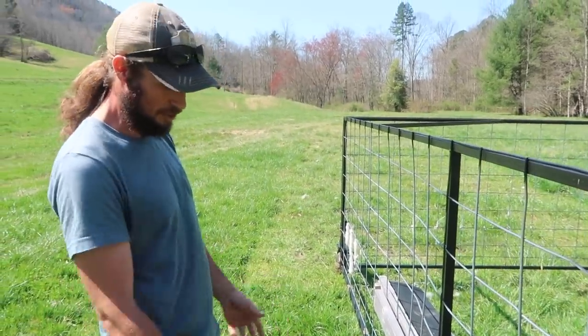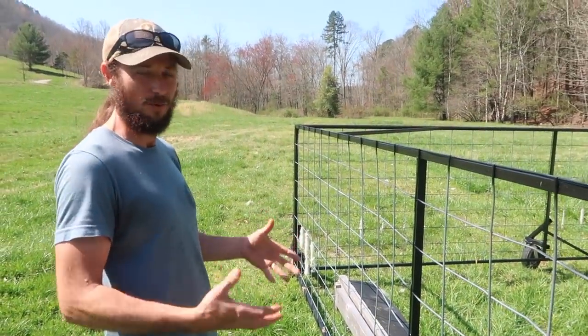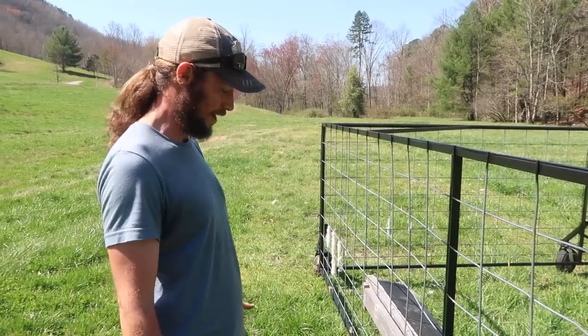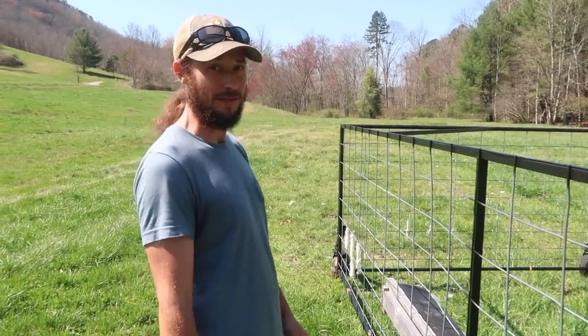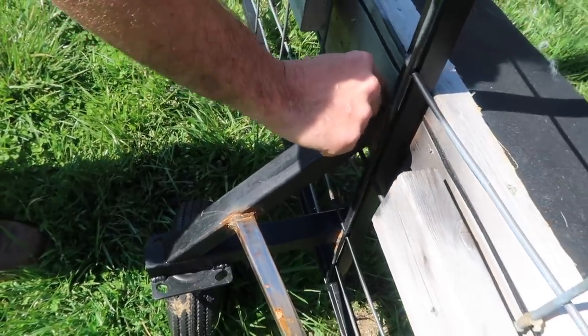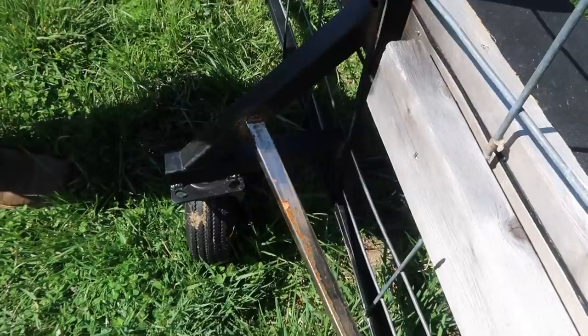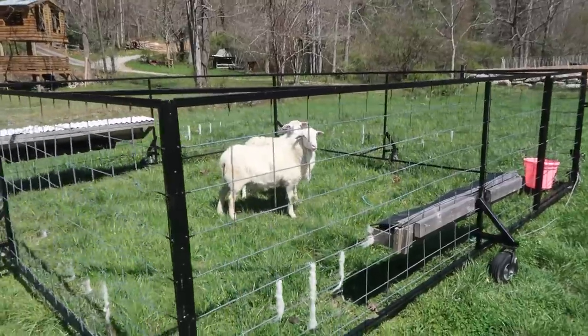And that was just something that should have been done. Gussets, you know, you need supports. And when I built it, we overlooked it. We hadn't talked about it. This is all 1.5 inch square tubing, and it's an 1/8 inch wall. And then everything else was 1 inch by 1 inch square tubing with a 16th inch wall.